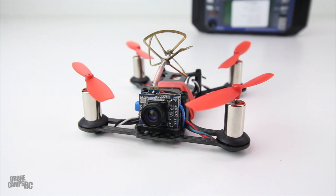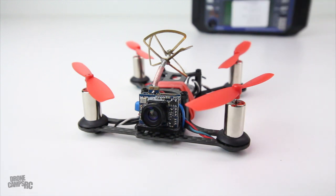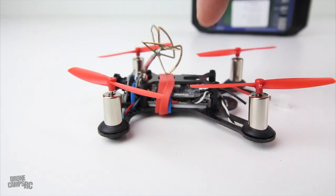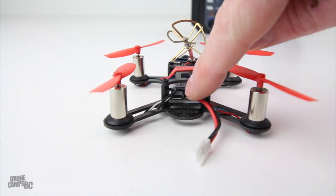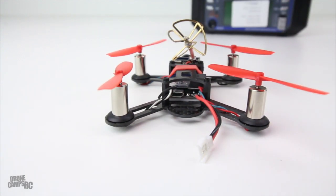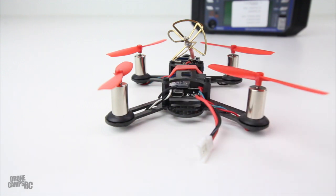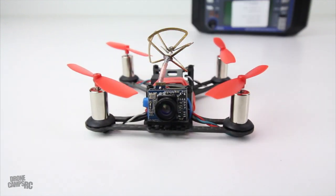If you're watching this video and you'd like to fly this quad but don't want to buy a FlySky transmitter, you can actually get this Bind and Fly — so you can fly it with your Taranis Plus or something with an FrSky receiver. I'll put that link below for you guys that have a Taranis Plus. The flight controller on here is an SP Racing F3 Evo brushed edition. You can go into Cleanflight and hook this up with the USB cable on the very back. If you're new to Cleanflight, go to the Chrome Web Store, download Cleanflight, install the drivers, and you can use it on Mac or PC.